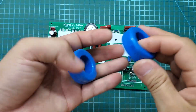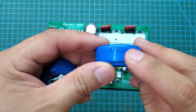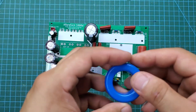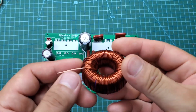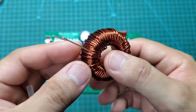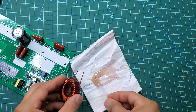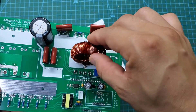Since this is a sine wave inverter, we will need an inductor for it. This inductor has a value of two millihenries. I'm using a blue ferrite core with a diameter of 40 millimeters for this inductor — it requires about six meters of copper wire. Next, I will use AB glue to secure the inductor to the PCB, which will reduce noise and prevent damage during transportation.